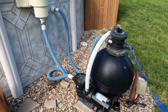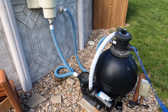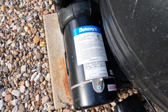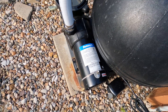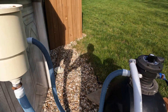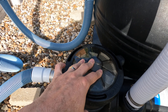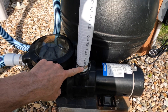We just bought this house about a year ago and didn't know anything about pools, but now we do. This is my help to you — to share what I've learned. We have a one and a half horsepower pool pump, I think it's a Waterway, model 6579 from Doheny's. It uses 12 amps running all the time. Water gets sucked in through the hose into the intake, through an additional skimmer basket in the pump, and then gets pushed up into the sand filter.